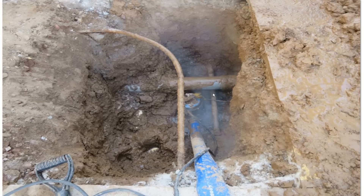It's just common for this property — old piping that water runs through. The ground had settled a little bit and snapped the coupling. The water was going the path of least resistance and started filling into that conduit. That's what the opening video was showing — water filling up and running down about 175 feet to the other end, filling up that service section. It's been quite an interesting project. Once we got the water leak fixed and let it dry out, the service dried up and everything's back on track now.